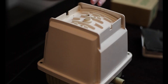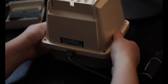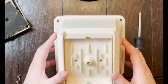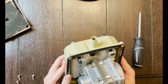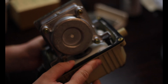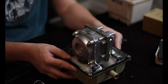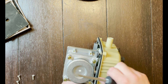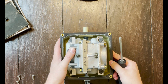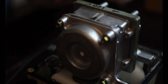The rebuild kit came with the piston and a replacement filter, so I decided to replace the filter as well. To remove the top housing, you remove the four screws in each corner using a simple Phillips head screwdriver — a very simple process. A little bit of pressure removes the top housing and exposes the linear piston pump itself. An important note: there are two housings on this pump but you only need to remove one. On one side you will find a green ground wire connected with a screw — do not remove that housing.